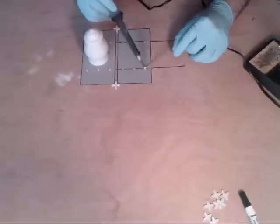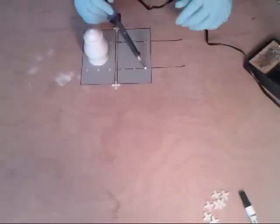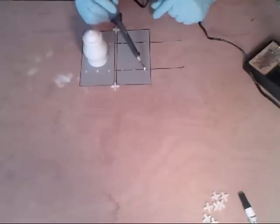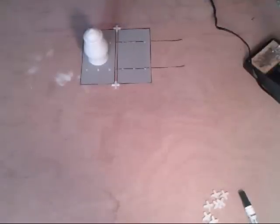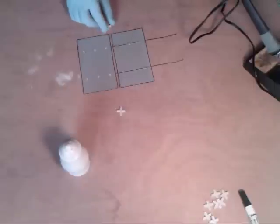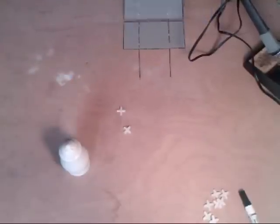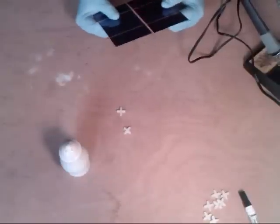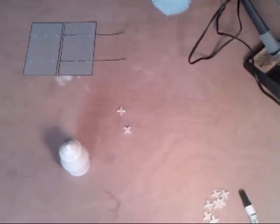The only thing I have to say about jigs is I have not built a successful one yet. The first panel came out okay, and so far this one is looking pretty good. Just slide these out — make sure you slide from the side, don't lift up. Now you've got two cells tabbed together. Continue on with this until you've got nine in a row, then set them off to the side. My next video will be how to attach the bus wire.